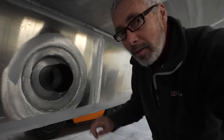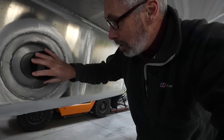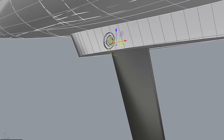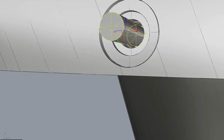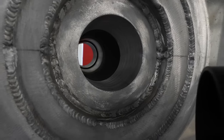This is the absolutely massive keel pin recess, so the keel pin is going to go in here. The keel pin is an extremely strong stainless steel cylinder that allows the nearly three-ton keel to swing smoothly up into the case. This is 120 millimeters across, so the pin is 110 millimeters and is made out of stainless steel.